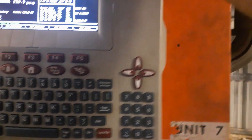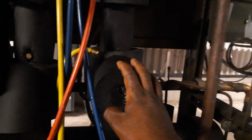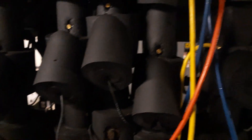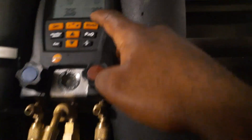Rack 8 is running at 34 degrees, 34 psi on the rack and we're at 38, so we're not too far off. We are maintaining suction set point. I've got one gauge hooked up to my circuit and one hooked up to my suction transducer - reading 36 right here. Going to that computer over there, it also reads 36, so it's reading fine. If it's off by 5 degrees you should replace it. Suction transducer is reading right, and we're at 30 and 30.